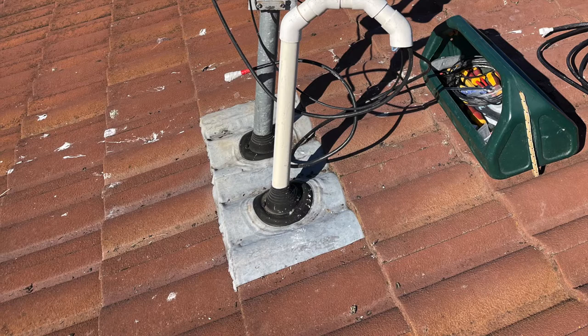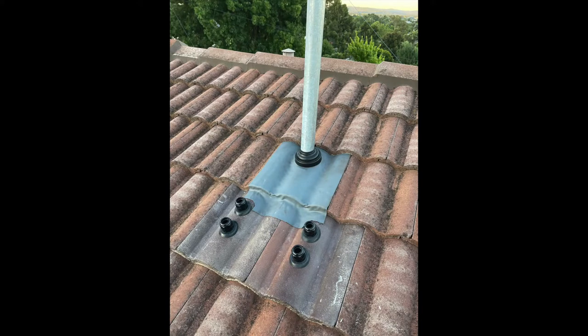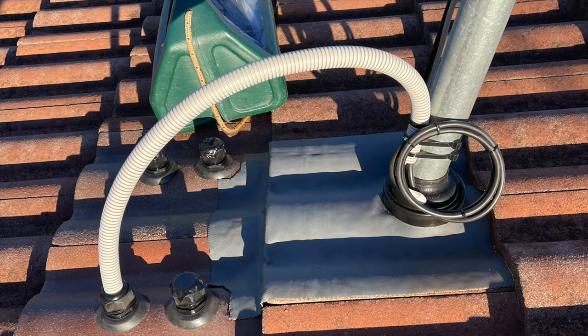There's something much better on the market, and I was very happy to discover that product — a cable gland made for concrete tiled roofs. It was a great discovery. As you can see in the picture here, it is very, very neat. It requires no structure underneath, seals 100%, and is ideal for the task of getting cables out onto the roof to our antennas. This picture shows how you can fit off the cable and it looks quite neat. You end up with a piece of conduit, and they can have one or more cables coming through depending on their size, and by putting a half loop in it like this, no water will ever get in.